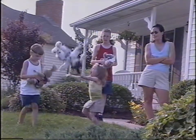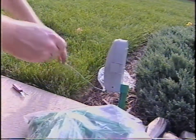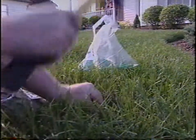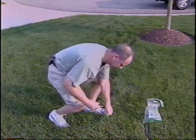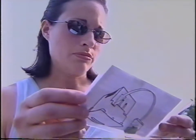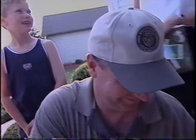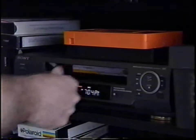Dan and Donna Cornelius volunteered their yards. This is a wire so the robomower knows where to stop. As soon as it hits that electric field, it knows to make a turn, turn around. After planting the sensor wire, we plugged the mower in. Nothing. What's that? Fuse to the battery pack. Remove the battery pack from the unit — it needs to be in. Fuse into its socket as shown. We definitely needed the battery fuse and to watch the instructional video.